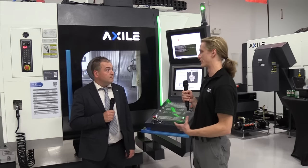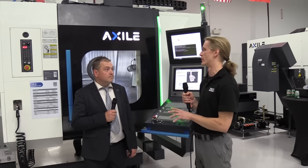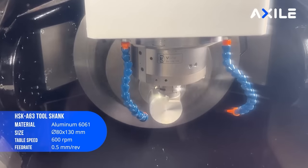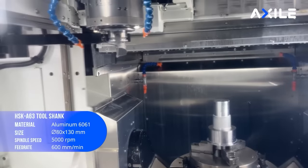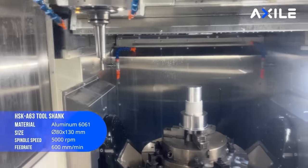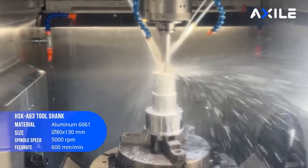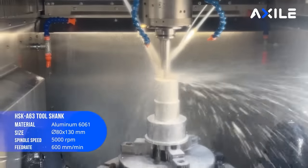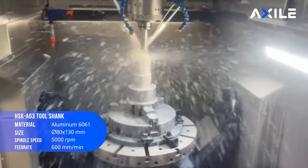It has a turntable with torque motors with 1500 RPM on the table, so it allows you to do a lot of those parts or components that may be more awkward to put on a lathe-type configuration and are better suited for a milling-type machine, and then it has the capability of turning. We're talking about parts like valve bodies, bearing housings, or maybe complicated military or aerospace parts that have certain features requiring a turning finish, and this machine can definitely do that.